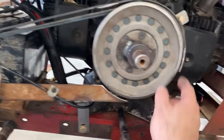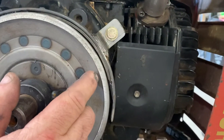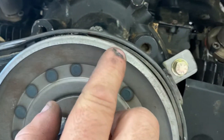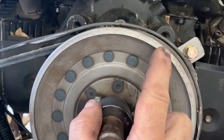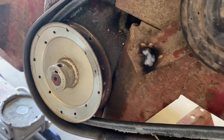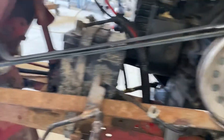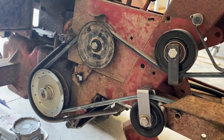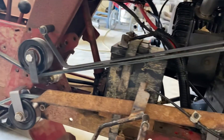This Creepy Crawler setup — I don't want this belt to fly off the front. This is how he designed it, and his machine works really good. This guard runs very close, and there's a little piece of 1/8-inch strap steel here and a piece of 1/8-inch strap in here. The belt isn't touching it right now, but when the clutch releases, the belt will ride on that — but it can't go anywhere. It's pretty much wrapped all the way around. So where is it going to pop loose? It's going to pop loose back here, making it much easier to get the tractor in and out of gear, change directions. I'm looking forward to trying it because I have had belt brake issues with this, especially when the belt's wet. That's a real problem when you get in the water and you've got to back up and cannot get that belt to stop moving. It's a hell of a setup. Preliminary tests show very positive results.